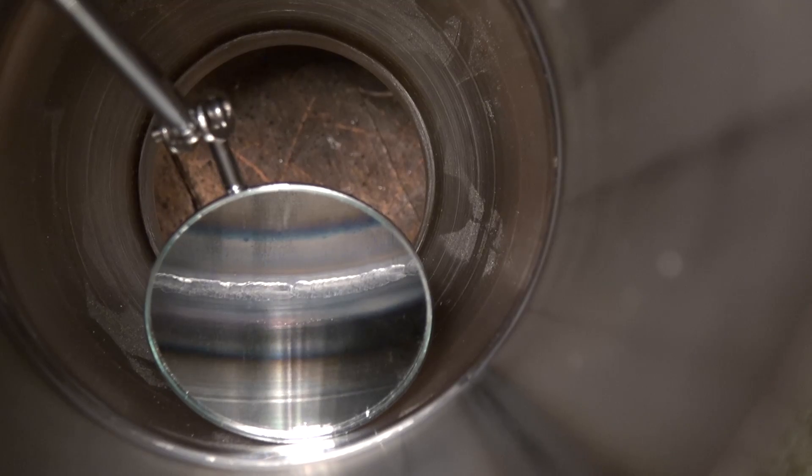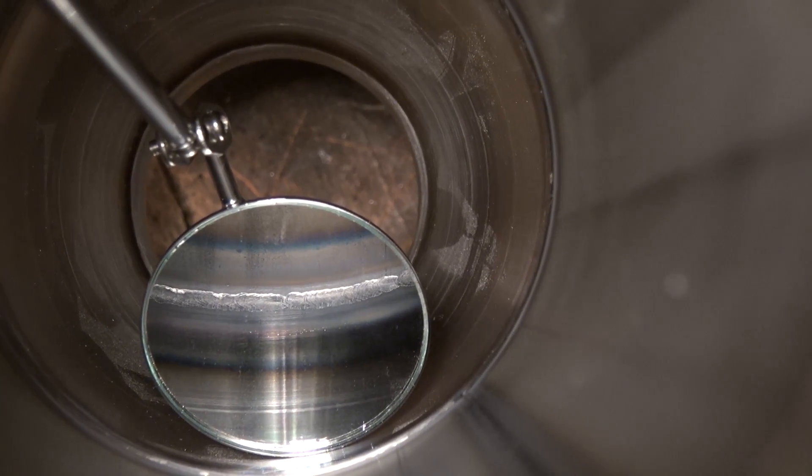If you give it too much heat or move too slowly, in the worst case you may get a sinkhole and a giant hole in the tube. If you don't heat it enough or you rotate it too fast, then you get an incomplete burn-through — basically a loss of weld strength. But if you get it just right, you get a bulge which becomes smaller and smaller until you have 100% burn-through with no geometric distortion at all. We're very close to achieving this in this case.